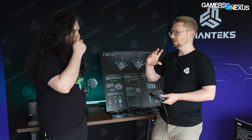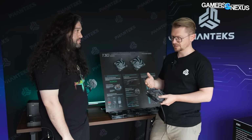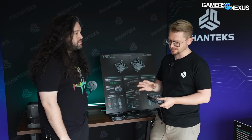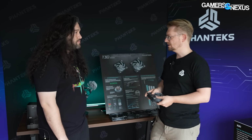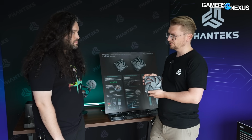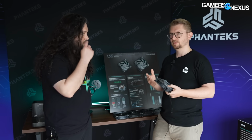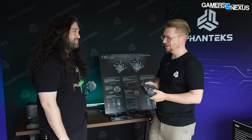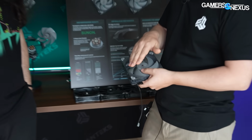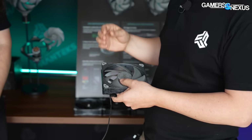And then all those materials and tooling choices end up in this number of, let's say, 0.8, 0.6, 0.9 millimeter tip clearance. And it's a good indication, but it doesn't say everything, right? I think this one we have on our T30 140, we have a tip clearance of 0.9, which maybe somebody else might say, oh, ours is 0.8, that's better. But there's more to it, right? Tip clearance is along the entire blade edge, right? And it has a leading edge at the tip, at the top of the fan, and the trailing edge.